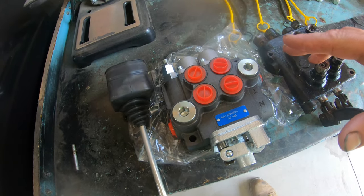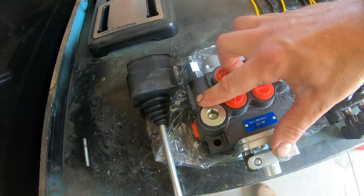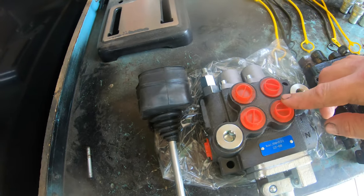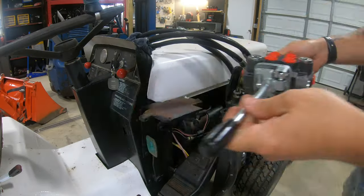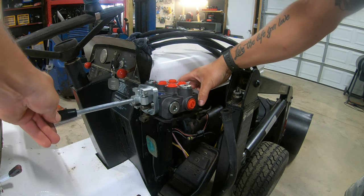And we gotta figure out if the hydraulic hoses for the main four going up to the top of the manifold are gonna reach and how much extension we're gonna need for the pressure line that's gonna be coming off the side with this elbow that I was telling you guys in the beginning. So let's go ahead and slap this up there and see what we find. All right, so dropping this loader valve in place here. You can see it's gonna fit the plate pretty well.